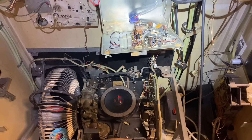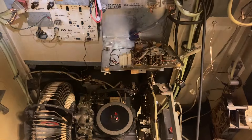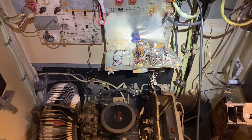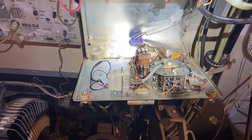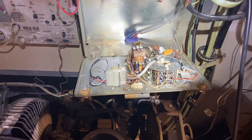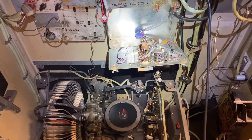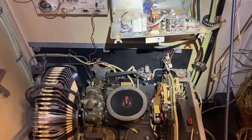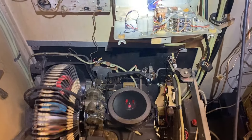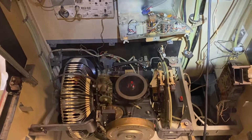We replaced the diode and we got ourselves a winner! We're going to select G5 and you can see all the components in the credit unit operate. 12 hours this took — holy smokes. I'll choose G5 since it's on top — boom, yes! The readout works and all the components in there are fired. On to the next case.